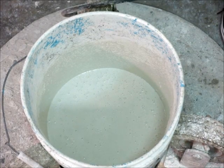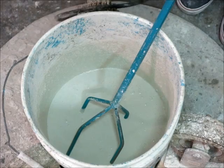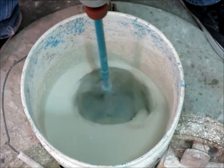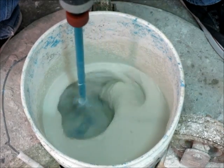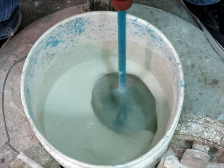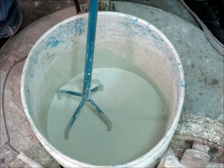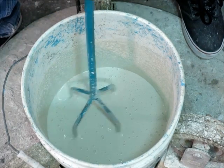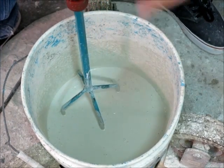Clean up is very easy if you have a wash bucket right next to your mixing station. Swap heads, switch from low speed to high speed — it's a simple matter of turning the speed selector. This is spinning much faster. Notice how there's no material being thrown up; it's all being thrown out against the walls of the bucket. Very efficient mixing, very high shearing. Does an excellent job at incorporating all the loose powdery materials and getting a very homogeneous blend.